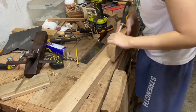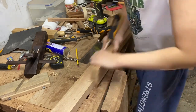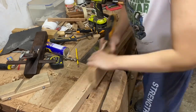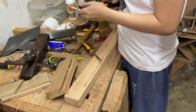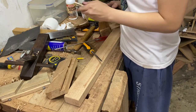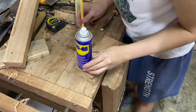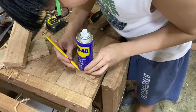So it works now, but then we'll need a better chip escapement, and as you can see, the dado was not cut well. I just fixed that with a chisel off camera. I just bevel the end with a chisel to create the chip escapement, but this is actually pretty tricky. Takes a few tries until you get it right, but at the end, it all turns out well. Here, I just curve the ends, bevel the corners, and make the plane more comfortable to hold.